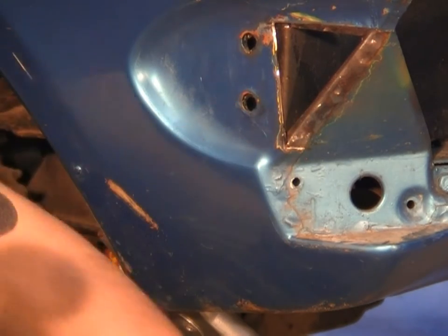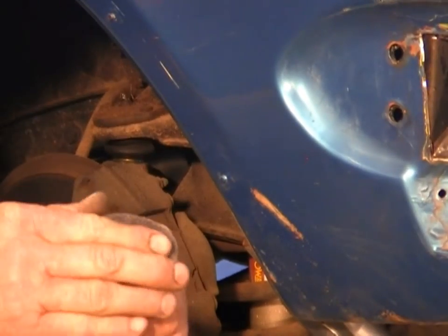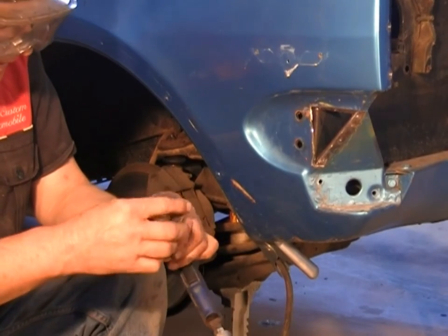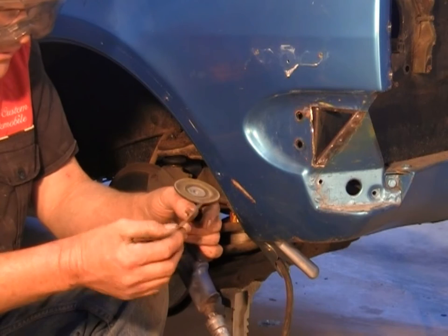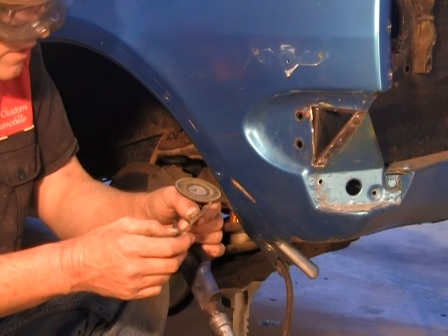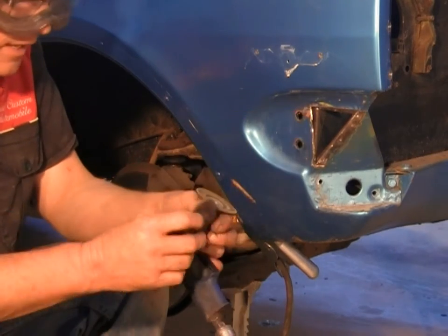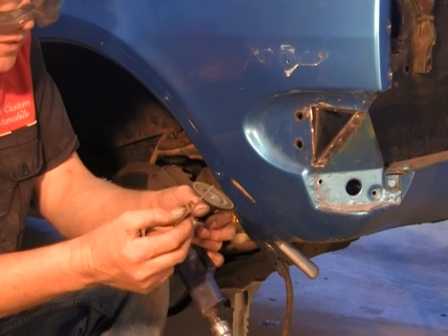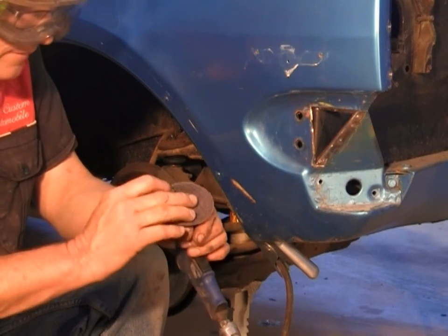Now, another thing that you guys might find interesting, these little grinding discs are called Rolocks. R-O-L-O-C-K-S. And they just twist onto these backing pads. They come in a variety of grits, and you can get a 75mm disc, you can get a 50mm disc, so it's 3 inches and 2 inches, and they're great. They'll fit into little places for getting things cleaned up, and I use them for finishing. So when I rough down a weld with 36 grit, I'll finish them with an 80 grit disc and things like that, just to clean them up and look a bit nice.